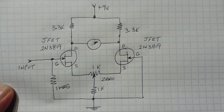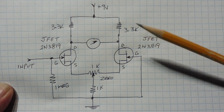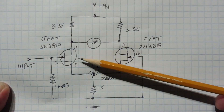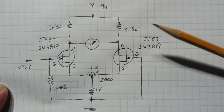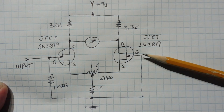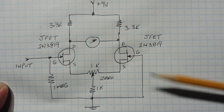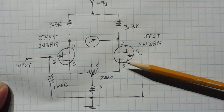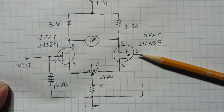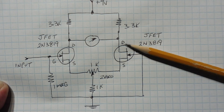Here's the schematic of my active Wheatstone bridge using two N-channel JFETs — two 2N3819s. The left-hand voltage divider consists of a 3.3K ohm resistor and the resistance of the JFET, which is a voltage-controlled resistor. The right-hand voltage divider mirrors it: a 3.3K ohm resistor and then the JFET. Both JFET gates are grounded because we never want to forward bias an N-channel JFET — it works in the depletion zone. The gate must be at the same voltage potential as the source or lower. When gate equals source potential, the transistor is fully on; as the gate goes more negative it pinches off and drain-to-source resistance increases.